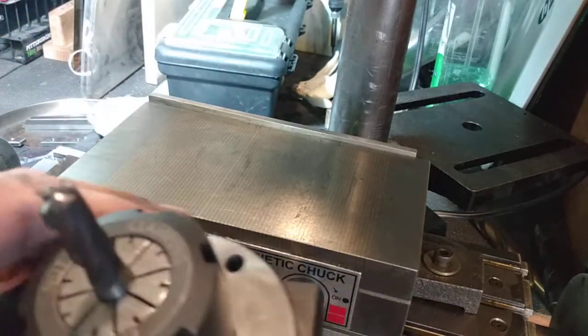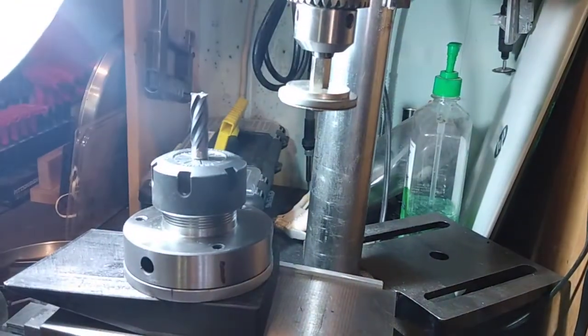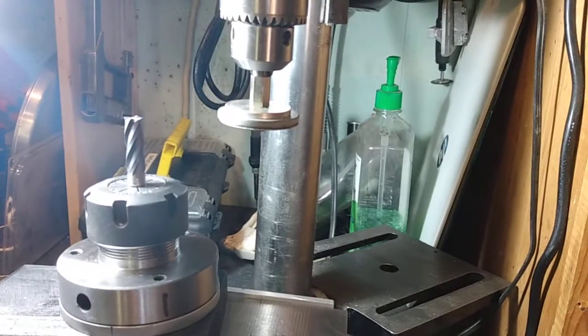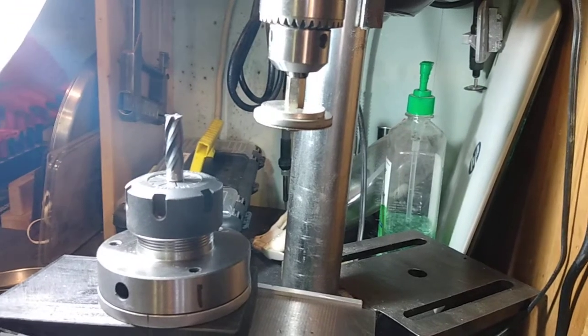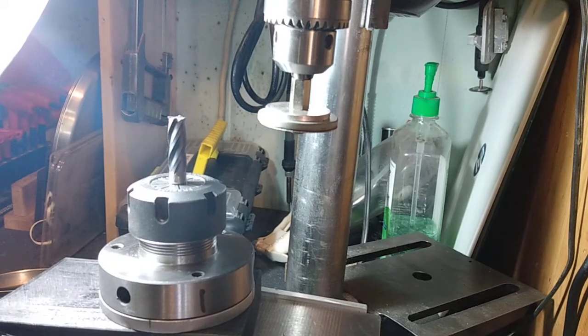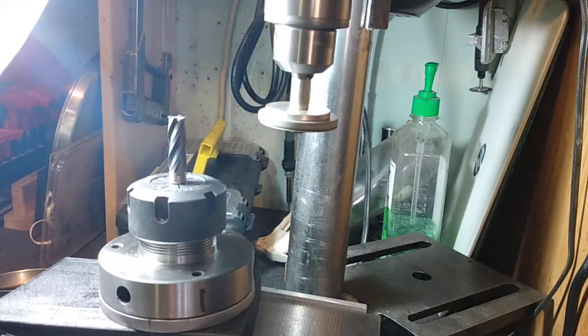That is sharp. A little diamond wheel — a little two-inch diamond wheel on an arbor with some backing. Not simply just washers, because they tend not to be real exact unless you make your own precision washers. You might get a little wiggle out of this, but that runs pretty true.